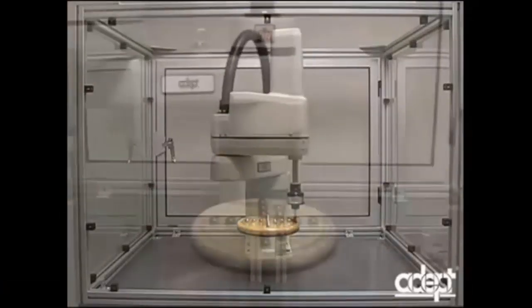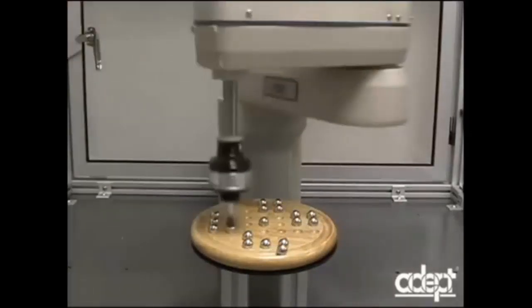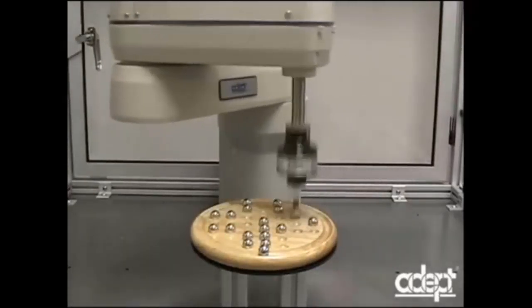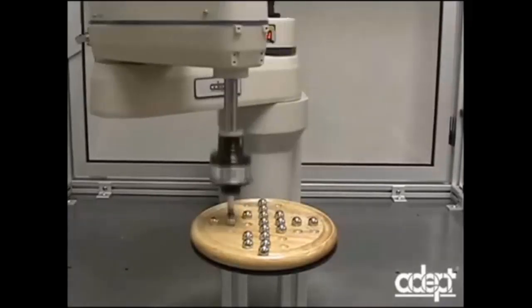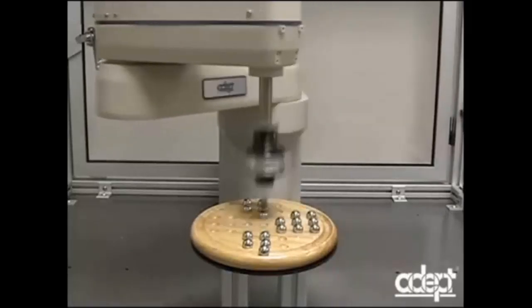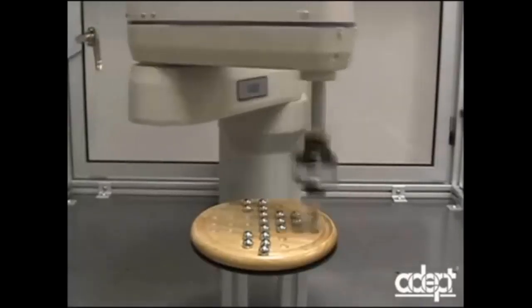So far, we have focused entirely on three degree of freedom manipulators. Three degrees of freedom is a good choice for manipulators because that's the minimum number of degrees of freedom, or joints, required for the end effector to have a three-dimensional workspace. We looked at several of the standard types of these three degree of freedom manipulators, things like the SCARA manipulator or the articulated manipulator. When we look at robotic manipulators commonly used in industry, we find that many of them match these standard forms: SCARA, articulated, Cartesian, and so forth.